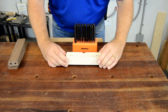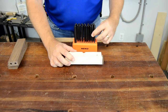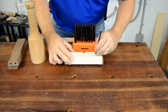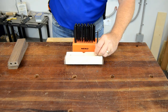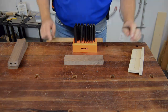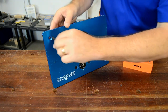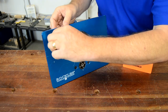Transfer punches are obviously not suitable for blind holes like the dowel centers are, but they allow for parts and jigs to be accurately placed and even clamped before use. In many cases, this makes them easier and more accurate. And transfer punches come in an indexed set that are sized to match drill bits, so they can be used with most of the holes that you'll need to drill.